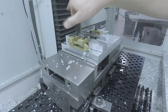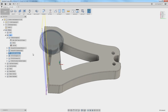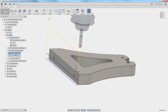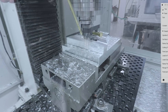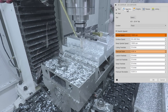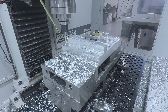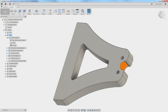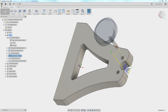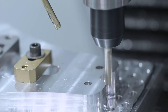So we removed those two clamps and now, in the same operation and the same setup, can machine that back edge. We're doing it in a few step-downs, just to make sure we don't overload the tool. This is a saw-cut edge, so we're not exactly sure how much material will always be there. 10,000 RPMs, 1 thou per tooth — the same as our finishing feed rate from OP1 on the inside area. Look at those chips — awesome — and a great surface finish. The SheerHog couldn't get into this tall nook, so we've got a rest machine 3D adaptive coming in at our faster feed rate for our quarter inch end mill. Always remember, in your adaptive on the linking tab, to boost your no-engagement feed rate — mine's at 75 here, but it really should be at your machine's maximum travel rate. Super nice to have access to all the sides of this part in one setup.